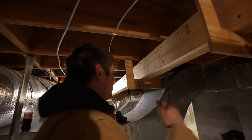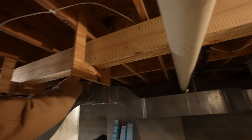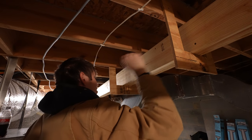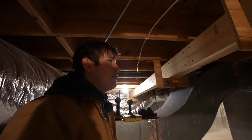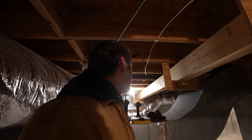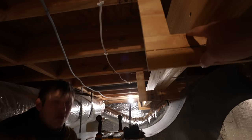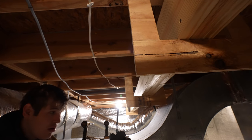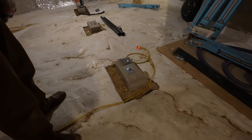And then we slid all of the individual boards in there and got them all to the same flush height, top and bottom, leveled it up, and screwed it together with clamps. So this girder's over 24 and a half feet long. And so what I did is I shot a laser level and I leveled all them up going down through there. And I marked my joist up there so that way I knew back and forth. And we are moving on to this. Let's get them screwed down.